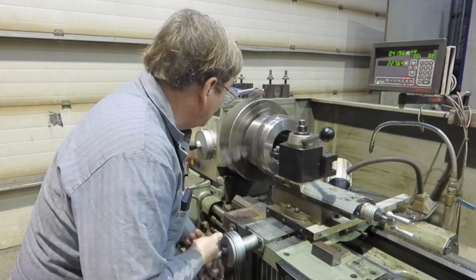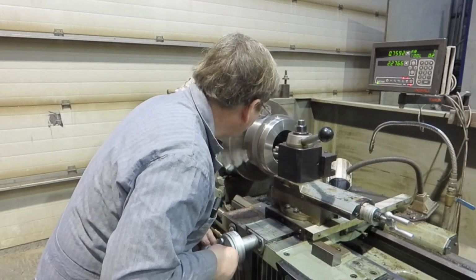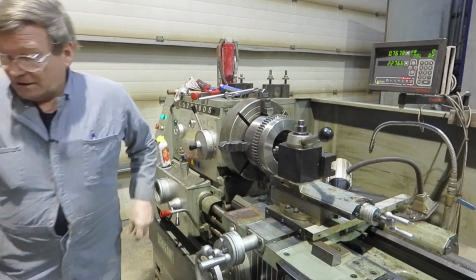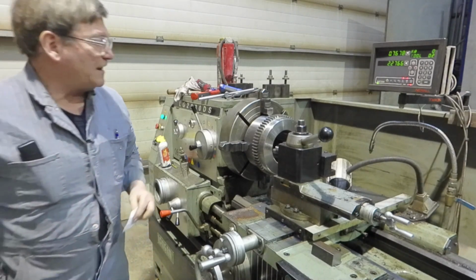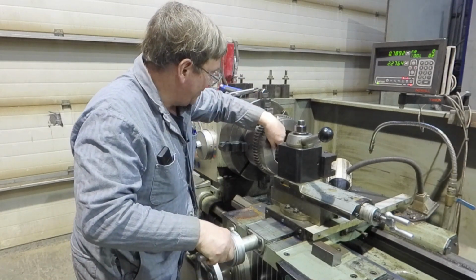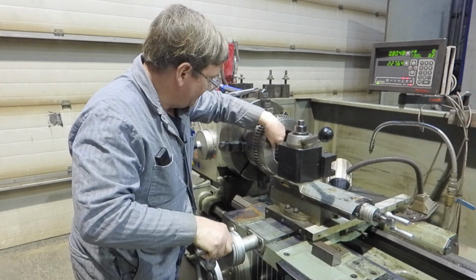I slowed it down a little more while you were gone. I hear that. Yep. Before I even touch off, I'm going to do the paper thing, because it was vibrating a little bit, had a little balance issue. Because of the keyway? Yeah, I hadn't really thought about what our weight was, but the keyway without a key in it. That is exactly what it was.